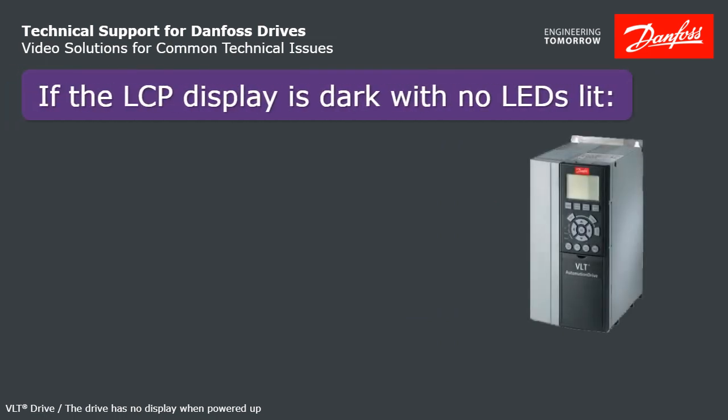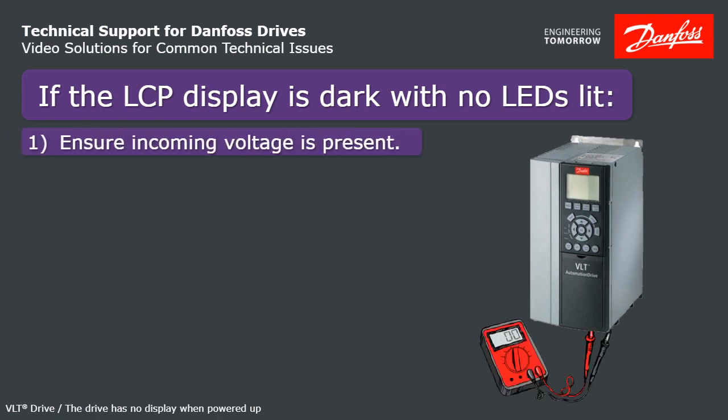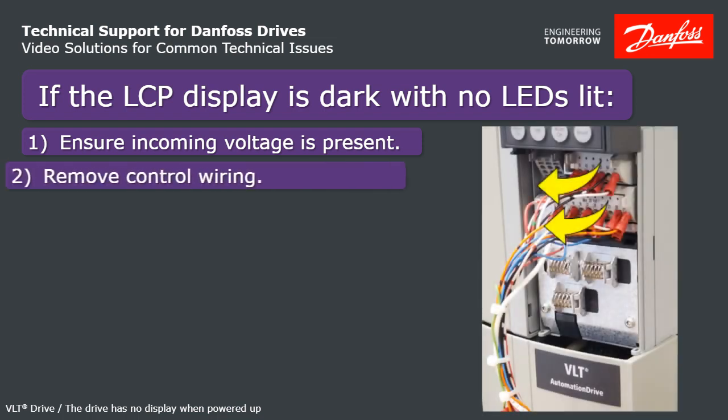Let's say that the display is dark, you have no LEDs lit at all. That could be a different story. Ensure that you have incoming voltage at the input terminals to the drive. You've no doubt measured incoming voltage, but consider, are you measuring upstream from some contactor or disconnect or circuit breaker or fuse block? If you have power going into the drive, just remove the control card wiring. If the display lights then, you've got a wiring issue.